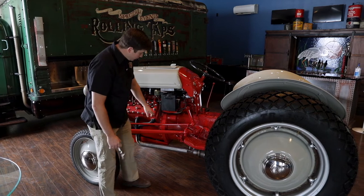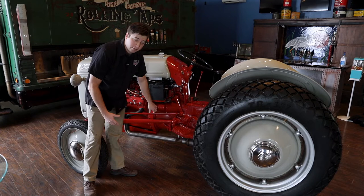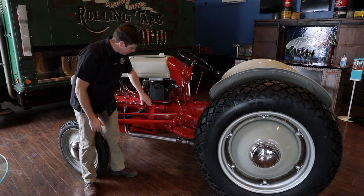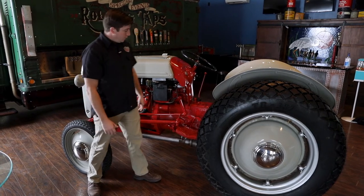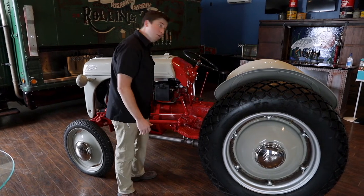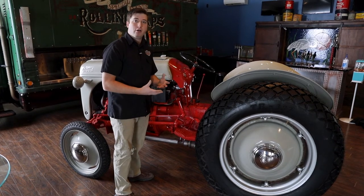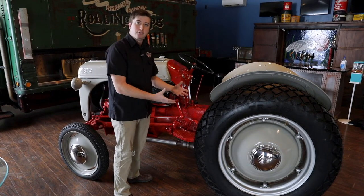To mount it to the rest of the tractor, we have this little adapter plate — it was actually an awesome Henry brand. He makes these kits for people that are out there doing it already. That allowed us to mount the 53 to the 48 without any issues, and the transmission and everything hooked right into it. The reason we used a 53 versus an earlier year flathead is the bell housing on those is actually part of the block, so I needed something where I could remove the bell housing and mount it right to the tractor.